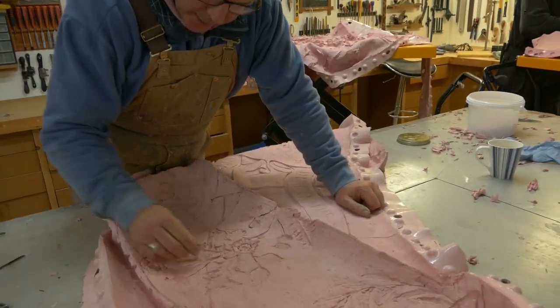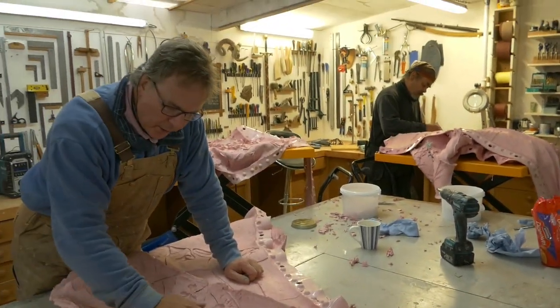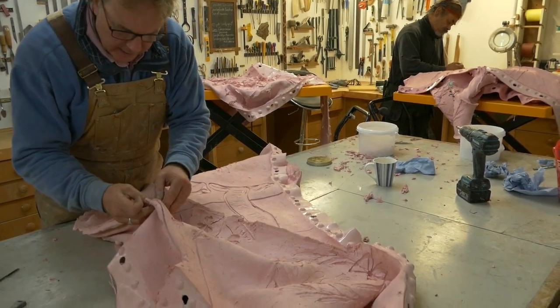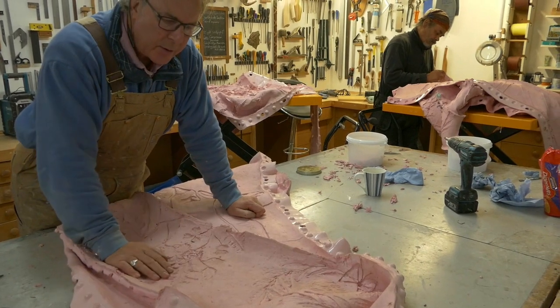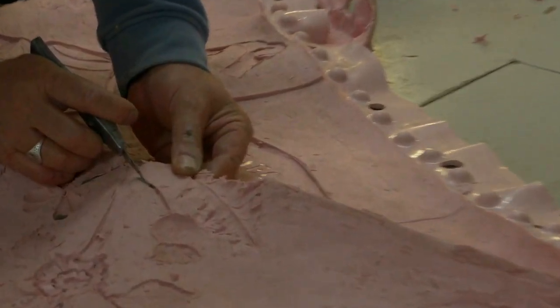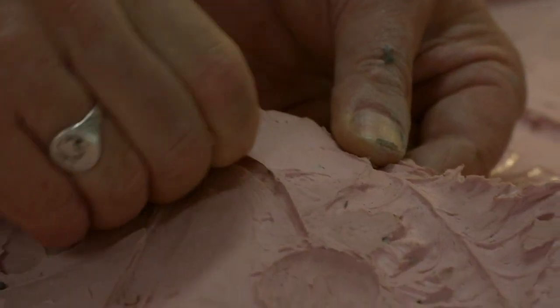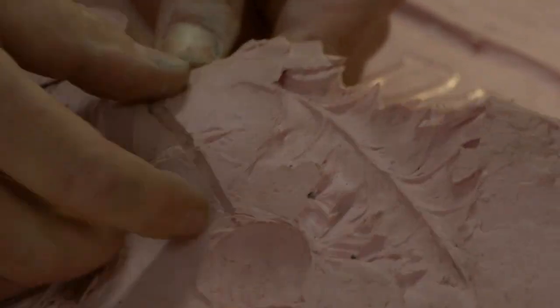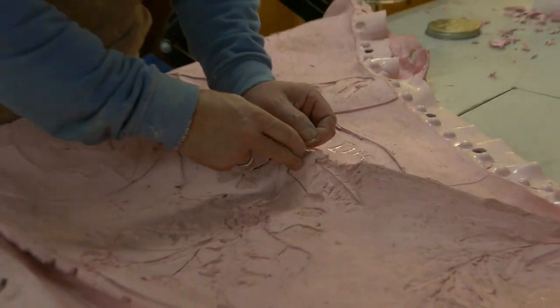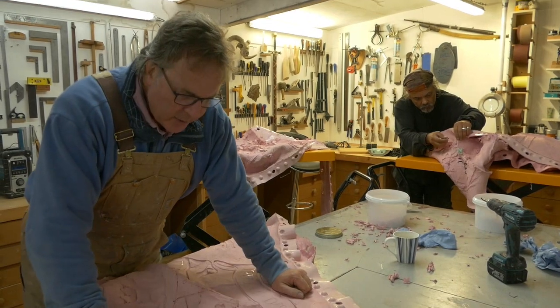It's worth the effort of just cleaning the mold up, pulling these little bits out, and exposing air bubbles — there's an air bubble just here. It's almost impossible not to get air bubbles on highly detailed surfaces like this, particularly when you are under a huge time pressure. Look, where the rubber has bled underneath there, it's actually gone right underneath the clay work, so I take the clay work out, pull the rubber away and clean it. I can expose all the detail that's lifted, which is due to the way the clay dries out and the resin materials lifting away from the surface — just things you can't really help.